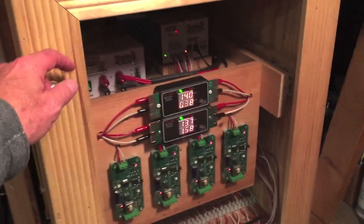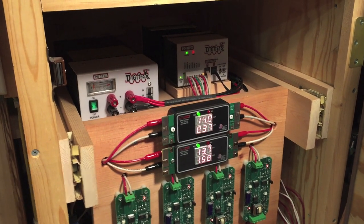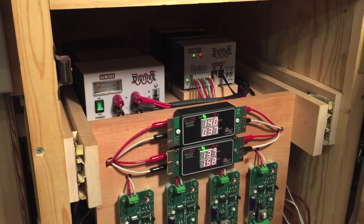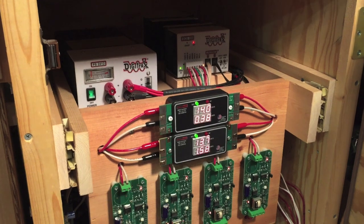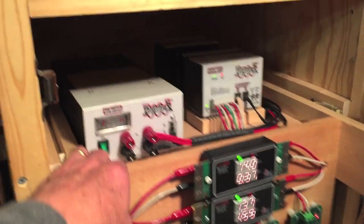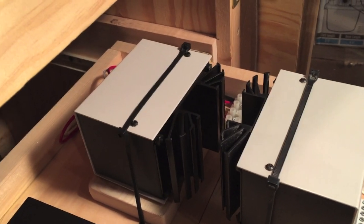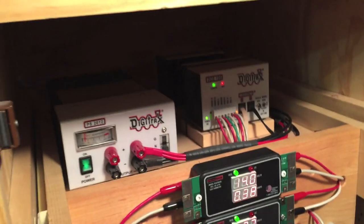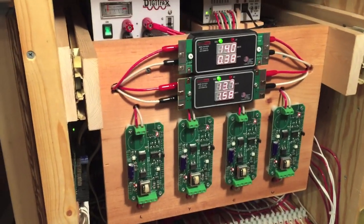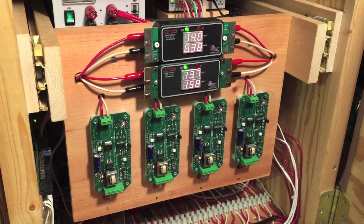As you could see, the transition from one to the other was pretty seamless. We've got the two amp meters; they're both reading about the same and move up and down with the amps being pulled — the top one's at 0.37 and the bottom is at 1.59. We put the second unit in backwards so that the cooling fins would be right underneath the cooling fan, which keeps things cool so there are no thermal shutdowns. The system seems to work just fine — we've been running for a bit and we're happy with it. Thanks for watching, see you next time.